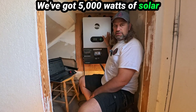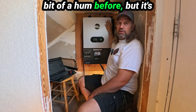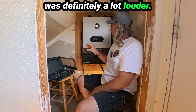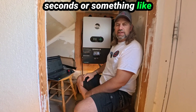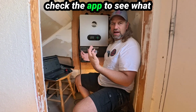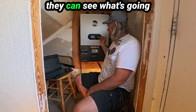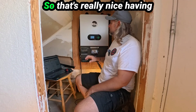We've got 5,000 watts of solar coming in right now — that's crazy, and it's quiet. It was making just a little bit of a hum before, but it's so much quieter than the Outback stuff I had. The 6000 XP I had in here temporarily was definitely a lot louder. It does once in a while just really come on and blow hard for about 30 seconds a couple times a day. One thing I really like is the kids can come over here, hit escape to light up the display, and see what's going on with the inverter if they want to check power usage.